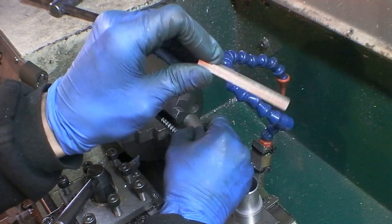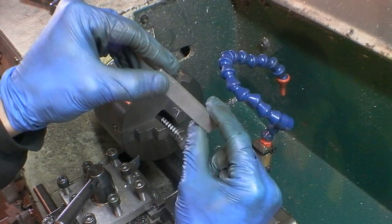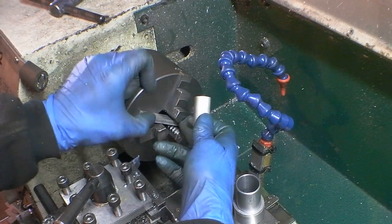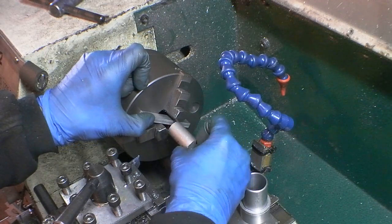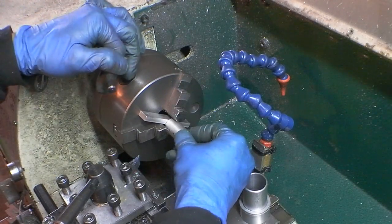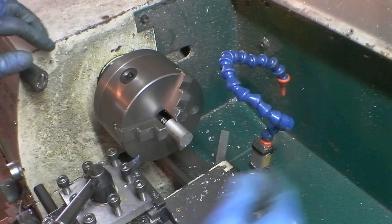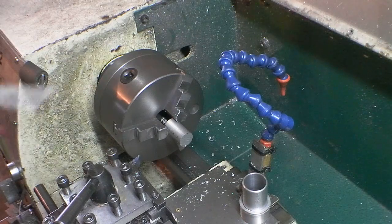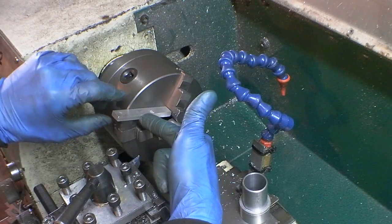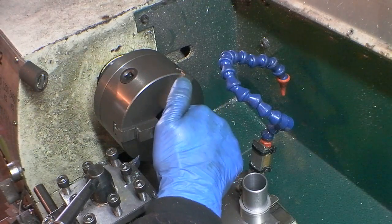Here I have just a piece of aluminum flat bar that I've machined 2.54 inches this way. The actual length is irrelevant. So I put it in here, lay it flat against the face, put my part in, hold it tight, wiggle it as I tighten it down, crank it, spacer falls out. Then I take the Z axis cutting tool and zero it against the face of this part. So now my Z zero is at exactly the back side of that part.